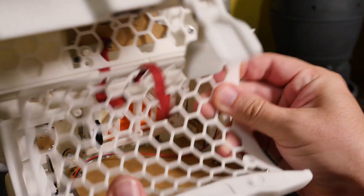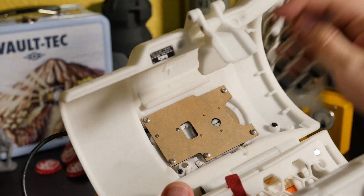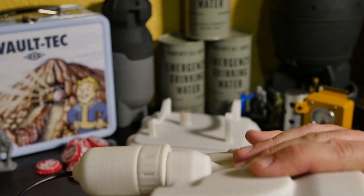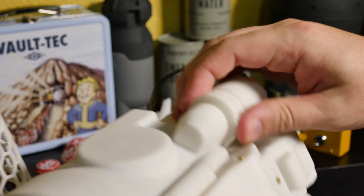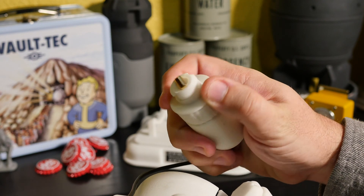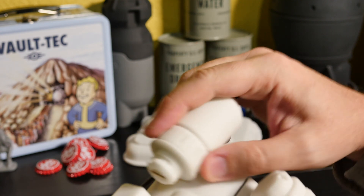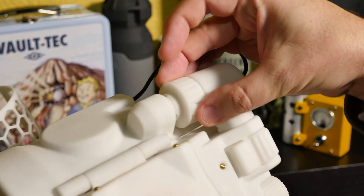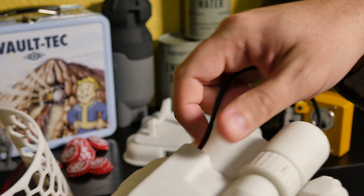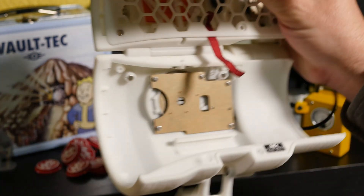The padding is going to be built into these kind of braces — they magnetically snap in. On the backside is the slip ring circuit board and power circuit board, which connects electrically to the communications cable. There's a really cool mechanism that pops out and then turns and locks into the Pip-Boy itself. The retraction mechanism is kind of the last thing I've been working on — it does work, but the spring is a little too strong, so that's the last thing I need to tweak.